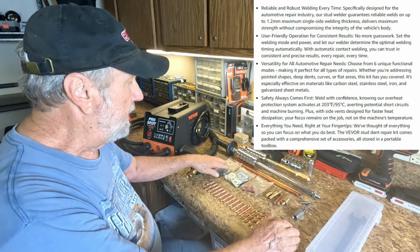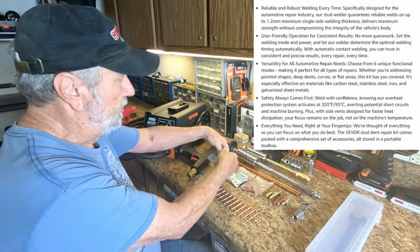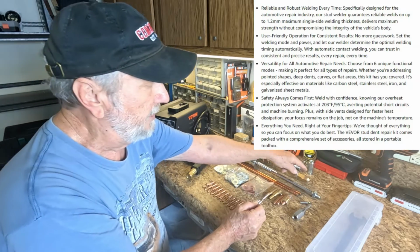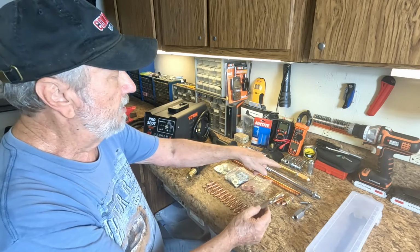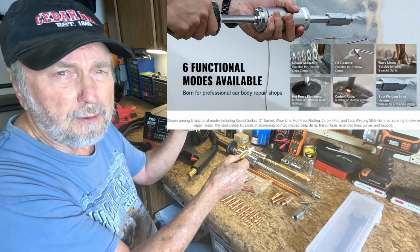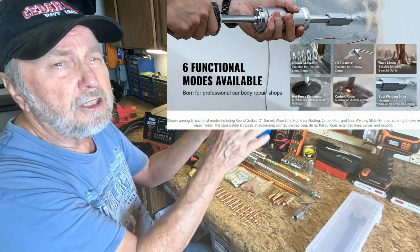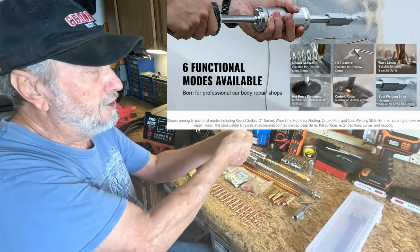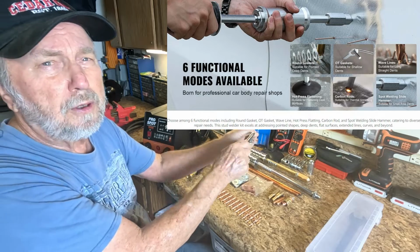Okay, let's go along and see the devices that you get. This welder is going to weld these little hooks. Actually, they're loops, and you're going to attach it to one of these devices or in there. Mostly it's going to go into this type of a device right here, and it's magnetic, and this is going to go in the end of the gun here, and you're going to be able to touch it to a piece of metal that has been prepared. All of the paint has been removed, and this is the job, that this will spot weld it to the part of the fender and not destroy the fender, only put a little dimple of metal on there where it was welded. And then to break it loose, you can just wiggle it and it'll come loose. But it's strong enough to allow a tool like this to pull it, as we're going to show.